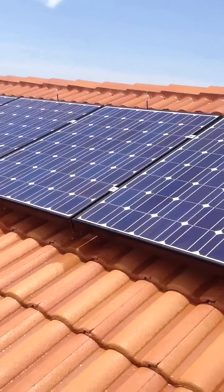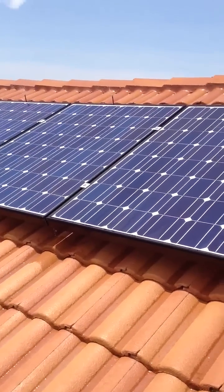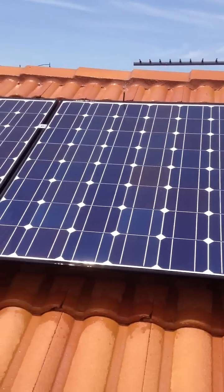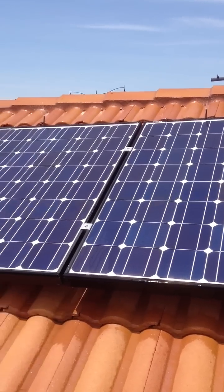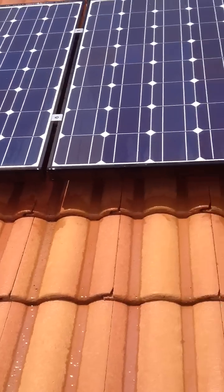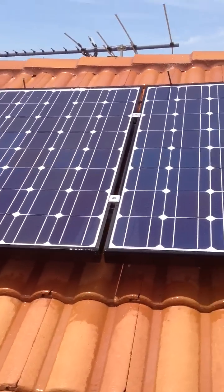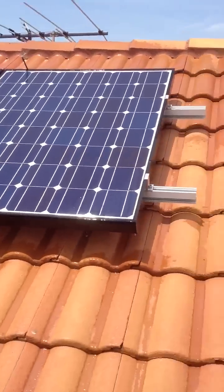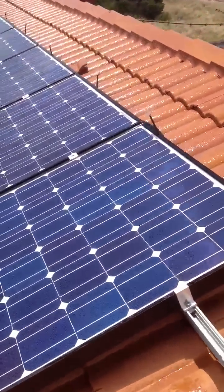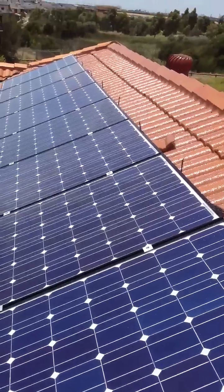It's only on a very fine mist. I was a bit worried about cracking the glass, but I figured the first lot of water coming up the pipe would be fairly hot anyway. So yeah, it works quite well — an extra 200 odd watts. I've actually had the best output from my system I've ever had, just by putting a bit of water on them.